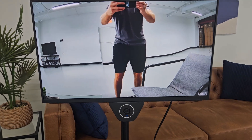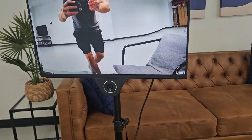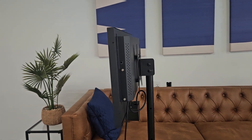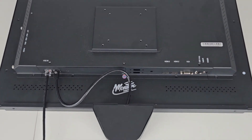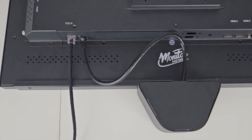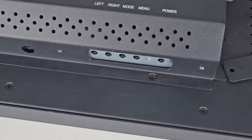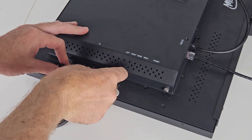This is a purpose-built monitor designed for the Ubiquiti UniFi G5 Turret Ultra camera. The front of the camera sets flush with the front of the monitor for a sleek and intuitive design. It's built with a heavy-duty metal frame and is designed for 24-7, 365 operation, and includes a three-year warranty. The entire setup is powered off of one PoE cable run, and the monitor has a PoE pass-through output to power the camera, with camera connections neatly tucked away inside the holder. The monitor is designed for commercial use and has a tamper-proof monitor control button cover, along with an optional peel-and-stick IR receiver if you prefer to use a remote control.